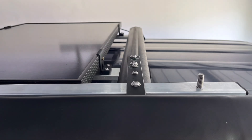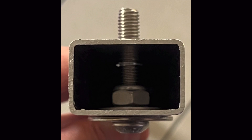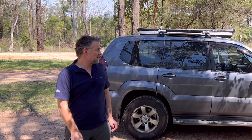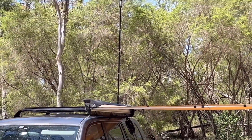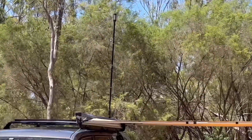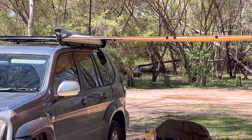My own twist on this is elevating the antenna from the ground without a tripod by mounting it on my vehicle when camping. I've got Crow's Nest National Park to myself. It's taken a bit of fiddling to get it where I want it, but there's a 1.2:1 match right down the bottom of the 7 MHz 40m band.